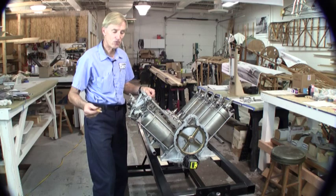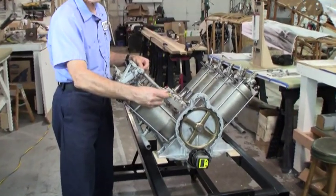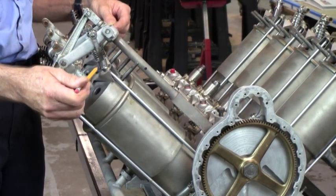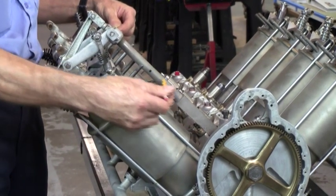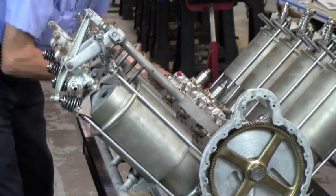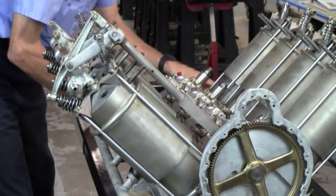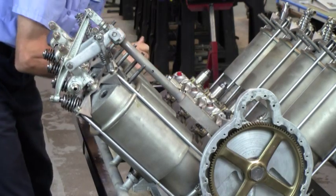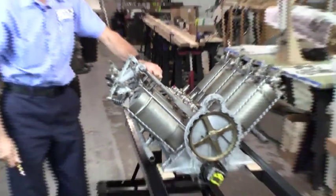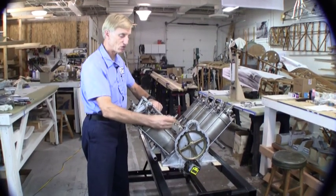Now I'm going to show you the inlet valve operating. The inlet valve is pulled open by this large spring here, which works on the back of the camshaft and not on the lobe of the camshaft. You will see the H-yoke here pulling the valve — or rather compressing the valve — as it's pulled down by this pull tube. We're now going to move the camera around to show you the main inlet valve spring operating on the follower.